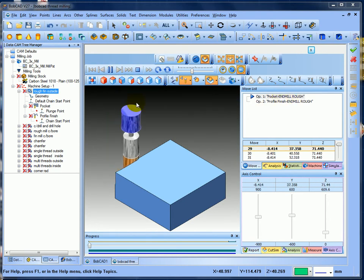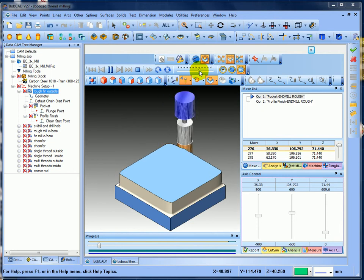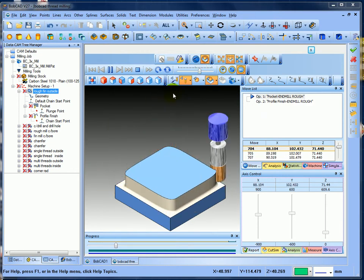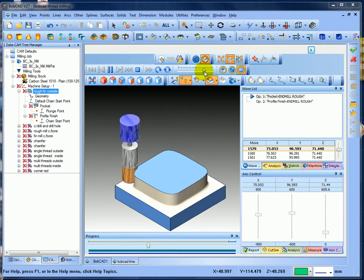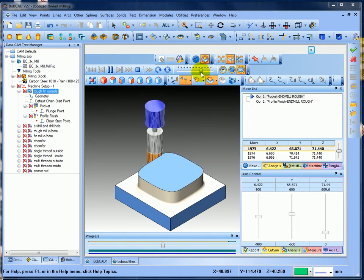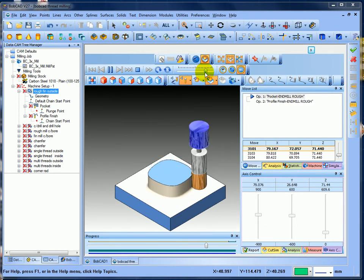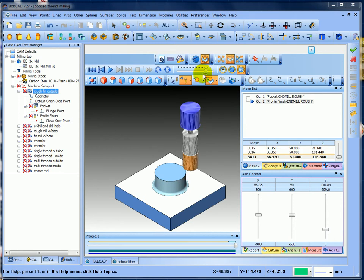You can see I'm coming on the side and gradually working in - let's speed that up a little bit. It's a bull nose cutter with a 3mm rad on the corner, coming round. Then if you run the second operation, it's gone around the profile and finished it.